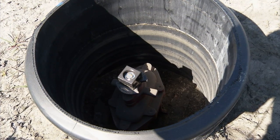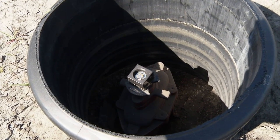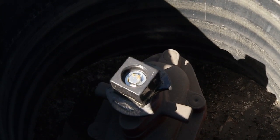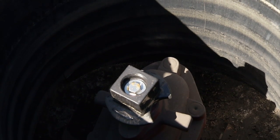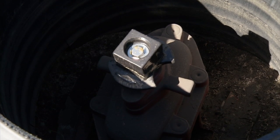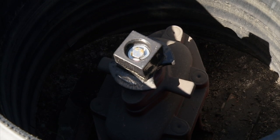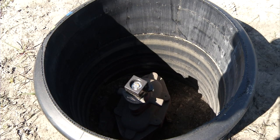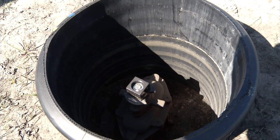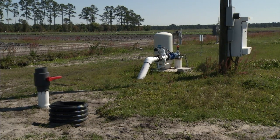What we're looking at now is a six-inch cast iron gate valve that we use to open and close the water supply going into our air drain system, which is fed by a six-inch line. With the gate valve we can isolate that system out of our main loop so that if we have to make a repair, we can shut down the air drain system without shutting down the whole irrigation system on the farm. The black piece surrounding it is simply a short piece of polyethylene culvert — it's there to protect the valve, mark its location, and prevent a tractor from driving over it.